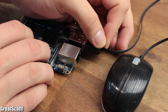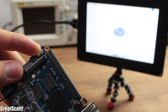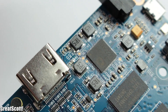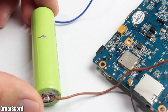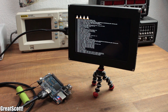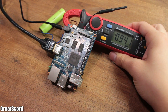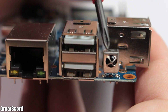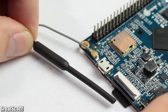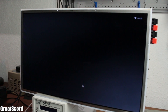We could also use the USB On-The-Go port for power input, but then not all USB ports work because the ICs are not powered properly. There is also a power button for the Banana and Orange, which is connected to a power management IC. This also allows the Banana to be powered by lithium-ion or lithium-polymer batteries, and yes, it can charge them as well. Those two boards also include neat extras like an infrared receiver, a small microphone and WiFi, which works flawlessly with Raspbian and Android out of the box.